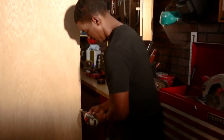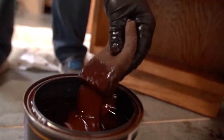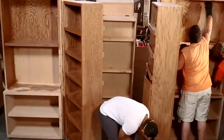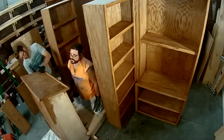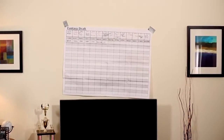The last step to completing this compartment is to attach the back. Cut two pieces of three-quarter inch ply to fit the width of the back and attach to the sides. Normally I'd finish this with a couple of coats of polyurethane, but because we want an extra classy look we'll add a dark stain. Make sure you give everything a good sanding before applying.